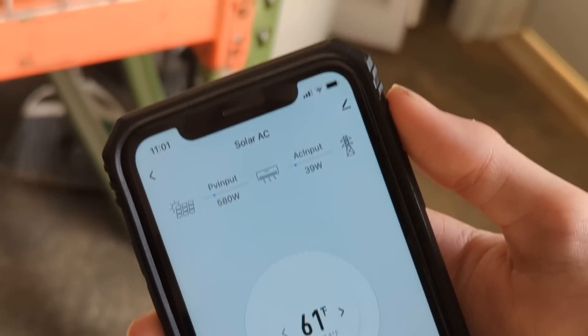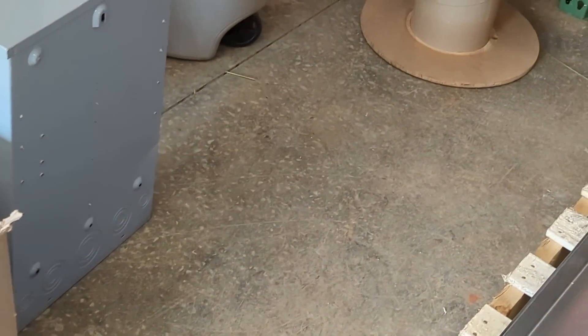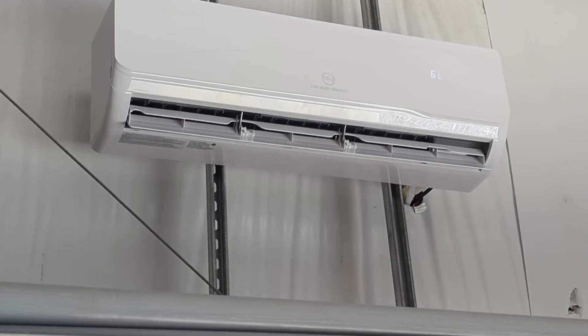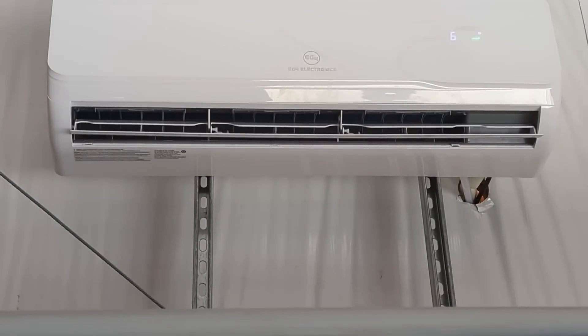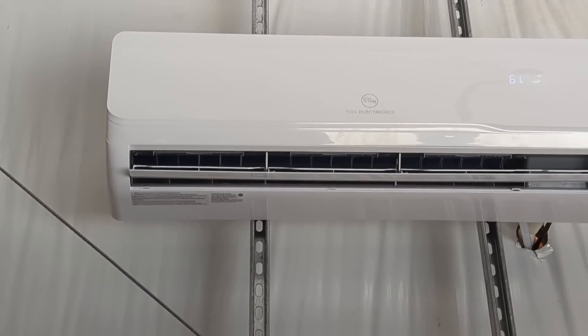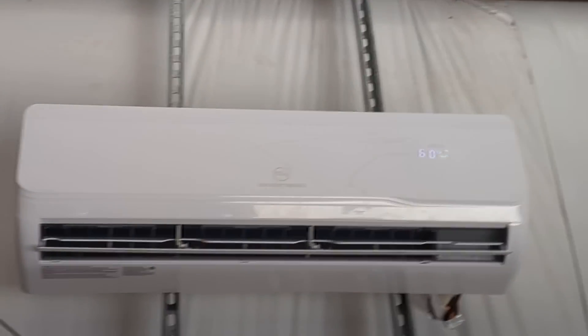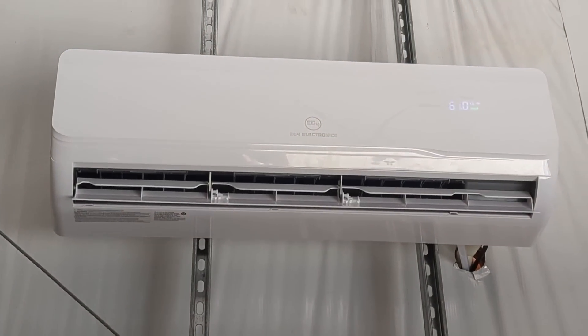We cranked it down to 61 degrees — as low as it'll go — and it's doing awesome. The floor is really dry in here now; it had been sweating the last few days but it's super dry in all areas. It is dehumidifying the space, which is exactly what we wanted — to take care of all these high-dollar batteries and customers' equipment, and we can do it pretty much on solar only. So that's it for the review of the EG4 24K two-ton unit. I like the two-ton for a building this big because it's got about 800 CFM fan versus 400 on the 12K unit, so on turbo it'll really blast you. Let me know what you think — this is Engineer 775, signing out.